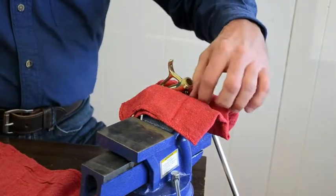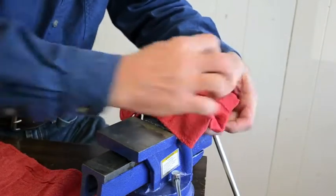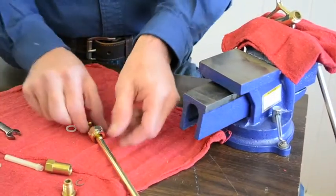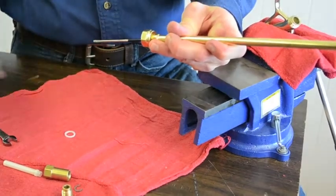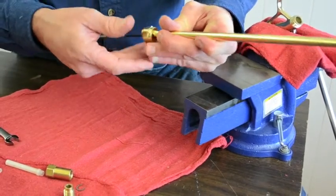Now this whole assembly will come out of the valve body. Obviously we want to keep up with all of these pieces — they can all be serviced and we have all these parts available. They're very necessary to prevent leakage where the valve body attaches to the lance barrel, so that's a serviceable and replaceable piece.